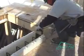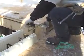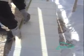Now that we know where this beam is, we know that we have to cut 26 inches and 29 and 3 quarters. So we're going to cut this piece out here — I've pre-marked it already, so 26 inches is here and then 29 and 3 quarters, and then the height of the beam. I'll cut along this line. This happens to be right on a tie, so we'll be cutting the tie out as well.